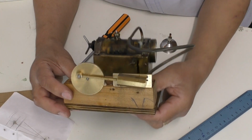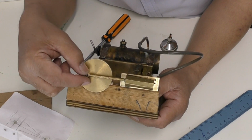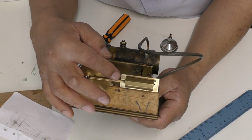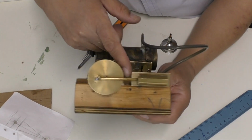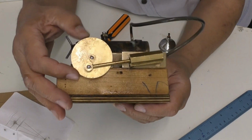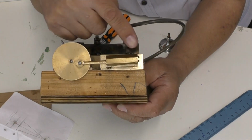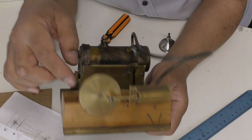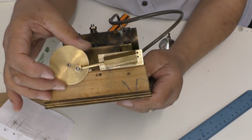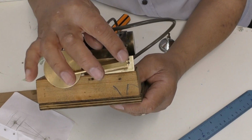One of the things I'd like to explain is this, that when this wheel is here, when this is fully out, this should be about level, it's there. So this should be about level there, okay? And when this is in, there, that side, this should be just about in, not fully in. I found that this particular thing was a bit more that way, so when you get to there, it was sticking a lot, because the bottom of this piston was hitting the bottom of that.